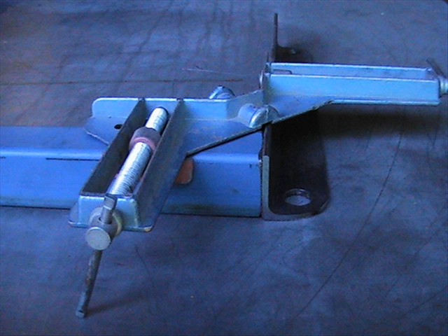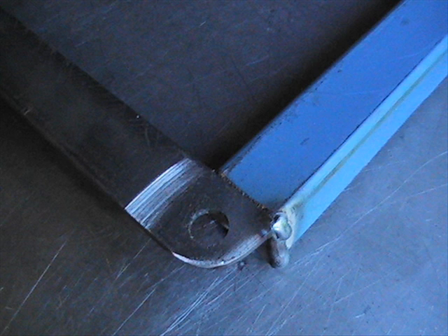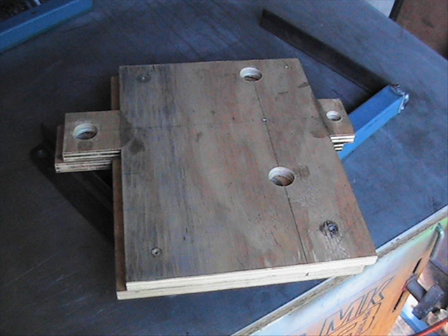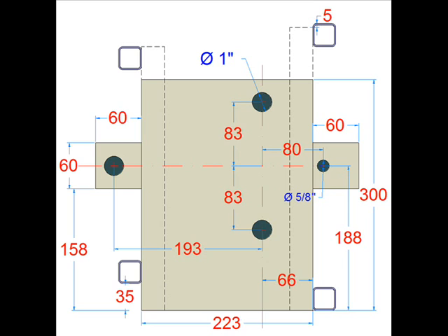The first step in assembling the frame is to weld the base angles to the ends of the blank horizontal brace — that is, the one without any holes drilled in it. It's very important that the corners are square and the frame sits on a flat, level surface. Using picture frame clamps can be very helpful to ensure that you get a 90 degree corner. Do not weld the inside of the corner, just the top and outside face. The next step involves the making of a drive shaft centering jig, which actually consists of two identical pieces of 12 millimetre plywood made to the shown dimensions. For accuracy and ease of construction, I first cut a long strip of ply at 223 millimetres wide on a saw bench.